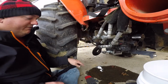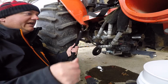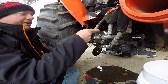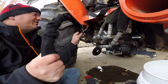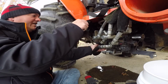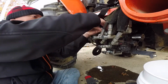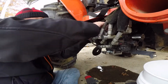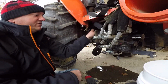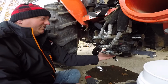But again, from the front side, we've got our 28 inch hose, and this one is just taken loose just to get it out of my way so I can get to this one with the wrench. But we're going to run our 28 inch hose just kind of up and over and in behind the brake lines and in behind the hose that we just put on, and we're going to hook it to our hose line number 1 that we took loose. And this one actually is going to run and make a U shape and go to the inside 90-degree fitting on our solenoid.